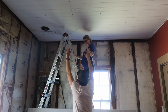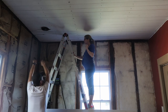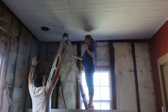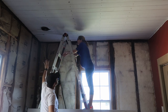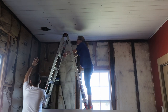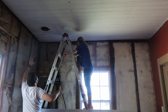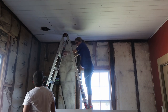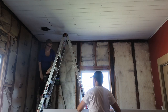Once we get it up there, we're going to position this sheet around to where the corner is — where it fits in the corner. You shouldn't have to hold a lot of weight; you're basically just going to be balancing. Once we get it over there, I'm going to take this stick, put it behind you to hold up that piece of sheetrock, then climb on this side and put some screws in. It might be better if you get on this side. All right, here we go — you ready?